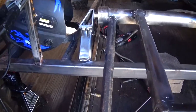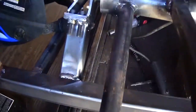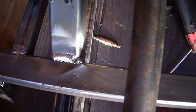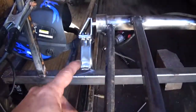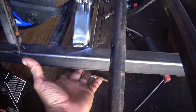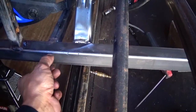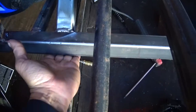Alright, got the risers welded in. Pretty much what we're looking at — there's your welded in. I got a weld going across the top and one across the bottom. Later on when I tear apart the frame I can weld up the rest of it. It sticks down below because when you cut a 45 on something it ends up being one and a half times the width of this. I'll put a gusset right here to add some strength.